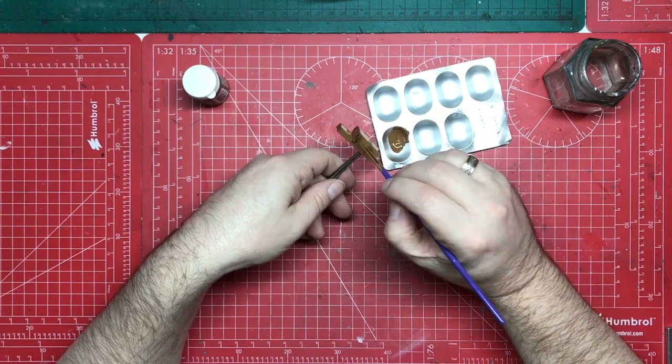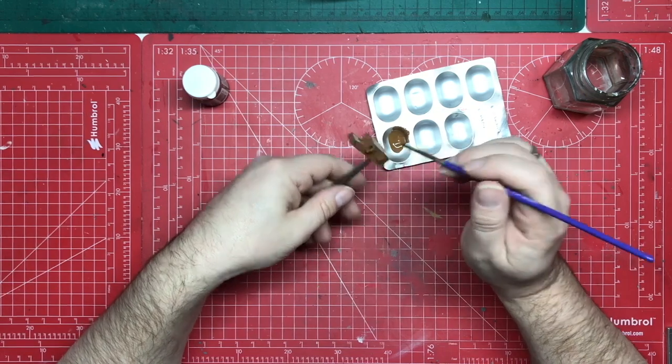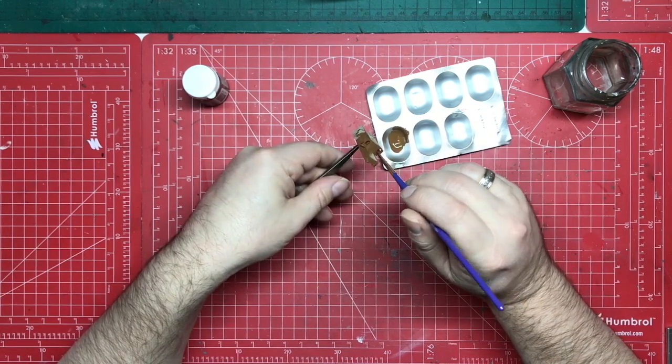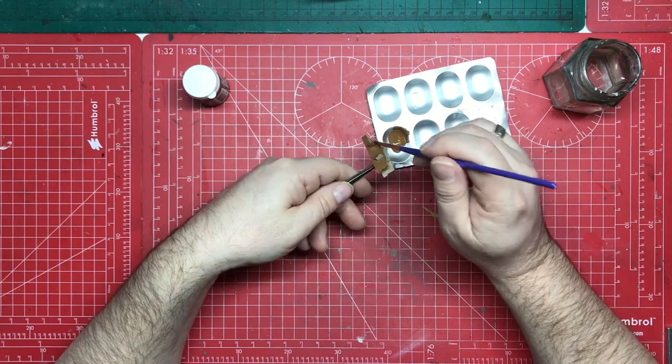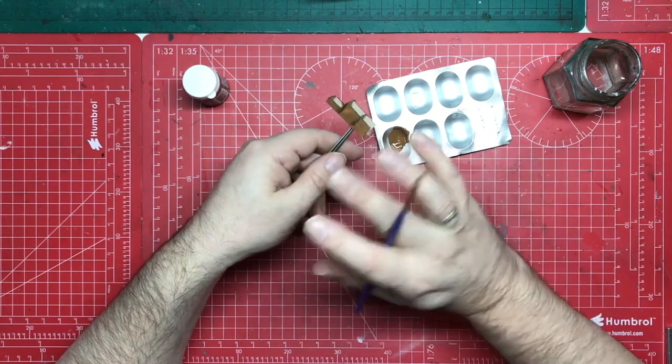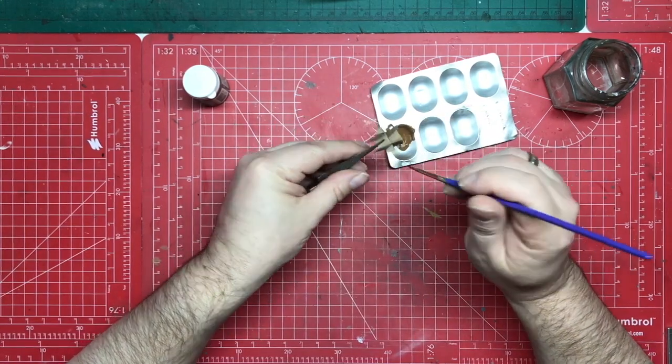But we do want to make sure that we've painted our ends, because that's going to be an issue. And then paint inside your opening where the windows are, but make sure you've got no drips or collection of paint that's going to stop your acetate going in when we install that.